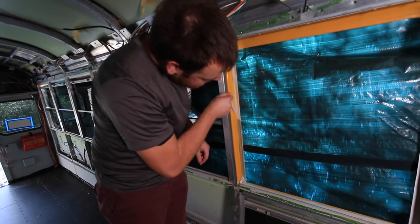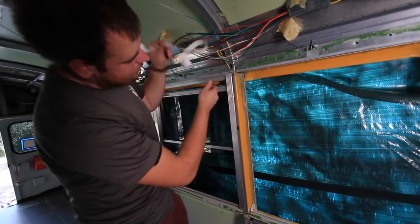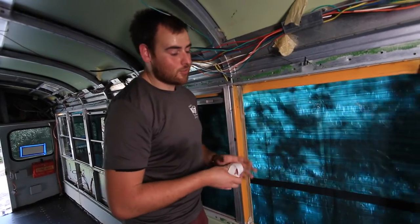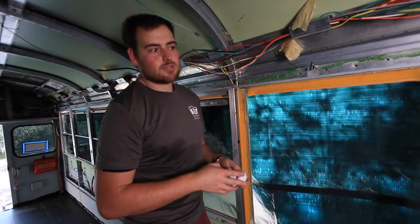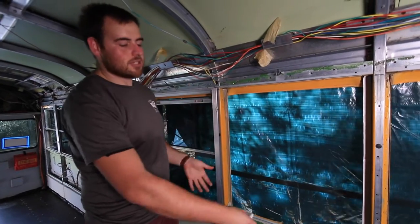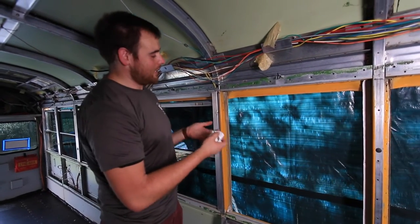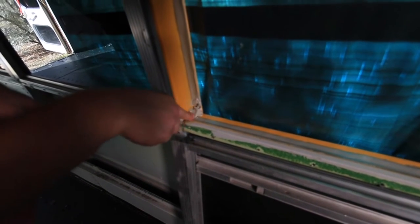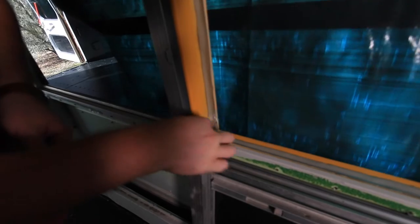Once it's adhered, you start peeling the backer off. The easiest way is to just rock the paper and it comes off pretty easily. The warmer the tape, the stickier it is and the more difficult it'll be, so if you can do it when it's a little bit colder, I would recommend it. We've got our tarp over here keeping the window sills cooler, which is making it easier to get the backer off. Keep an eye out for the corners of the window — take an extra piece of the butyl tape and really just pack it in there nice and tight so you don't get any water creeping up behind the window.